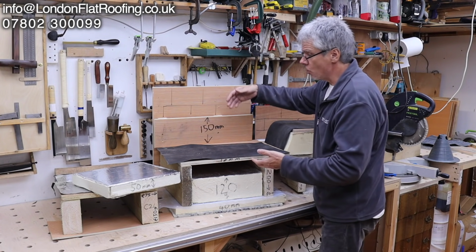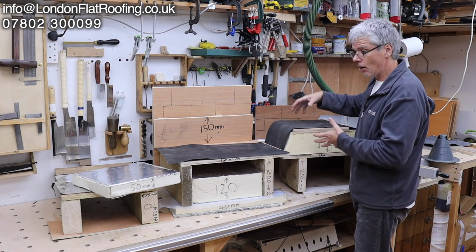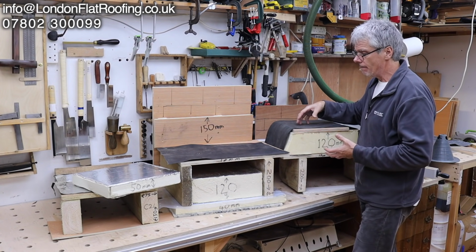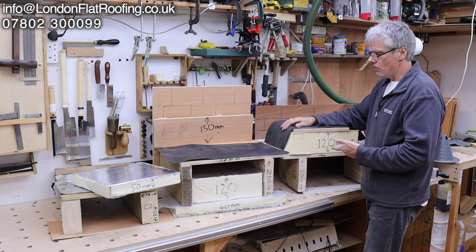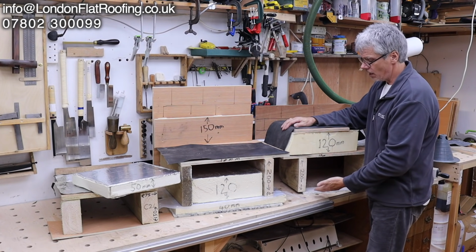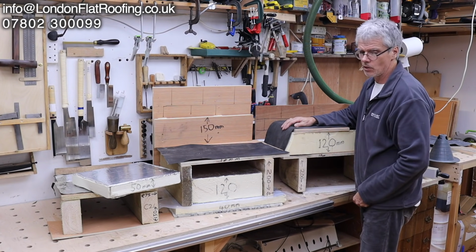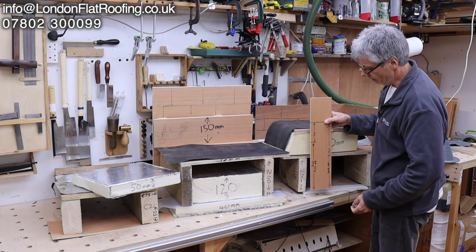Now, you go back to the warm roof, which is a much more robust construction, because you don't have to have good ventilation, you have no ventilation. There's a lot less to go wrong with this if you build it correctly. There are too many parts to this that could go wrong. Now, why do people want to keep building this when you can build that? And the answer is, look at the height difference between the two. I can show you that height difference with this.